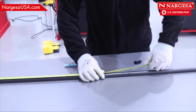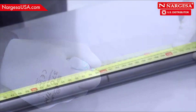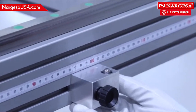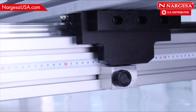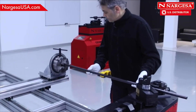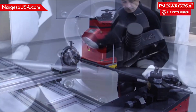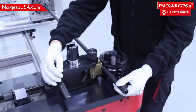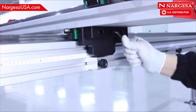To adjust the limit, measure a pipe section and mark a specific dimension — in this case, 1000 millimeters. Position the stopper at this mark and slide the carriage to the stopper. Place the pipe in the four-hook tray and adjust until the mark on the pipe is lined up with the die. Insert the counter shape, secure the guide screws, and the limit is ready to work.